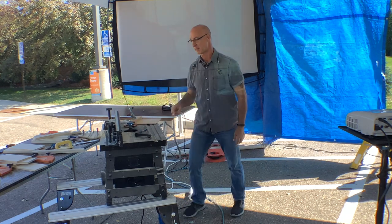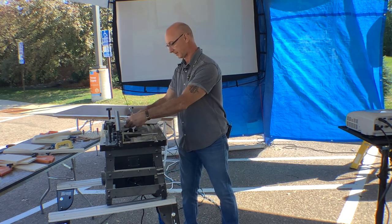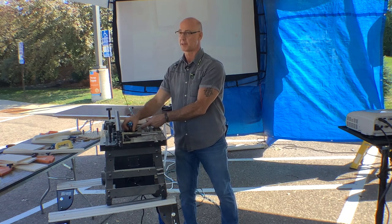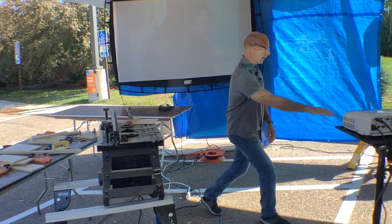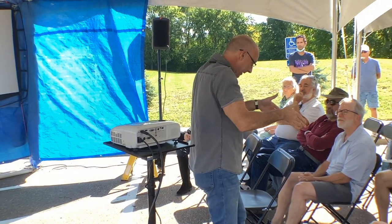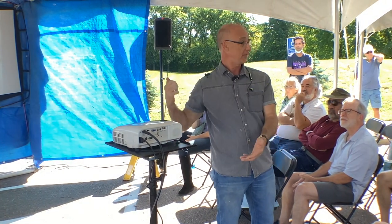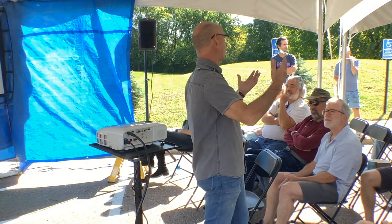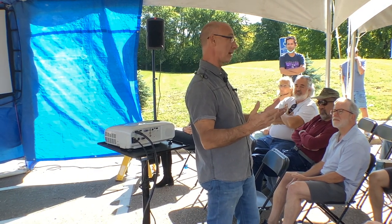Let me say something else about those marks. A thing I make a really big deal about in my classes and videos is it's really important to do all of that marking. Take your door parts to a bench, put on the Imagine Dragons radio on Pandora, get all your pieces marked, where in that second all you're thinking about is the door parts. You're getting everything labeled, you're making the roadmap for when you get to the router table. What we're doing here is very isolated. I'm cutting one or two or three pieces. If you're making a kitchen full of doors, you could be cutting 40 pieces.